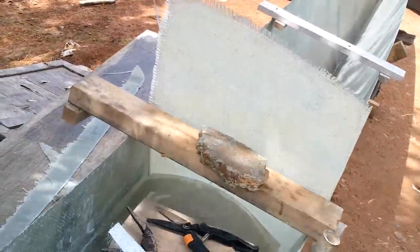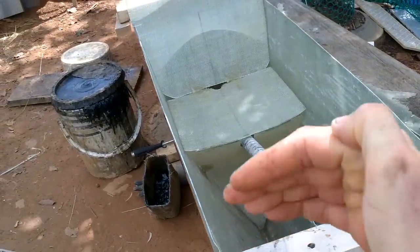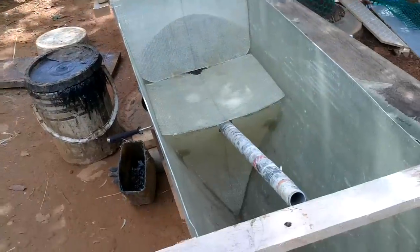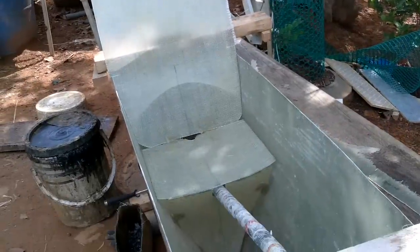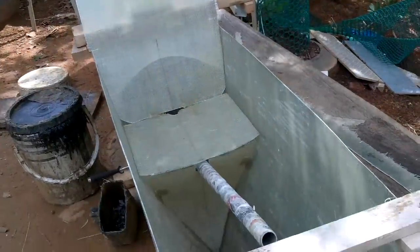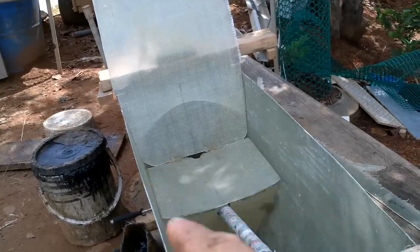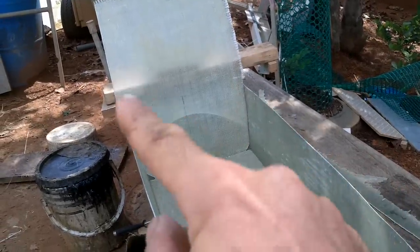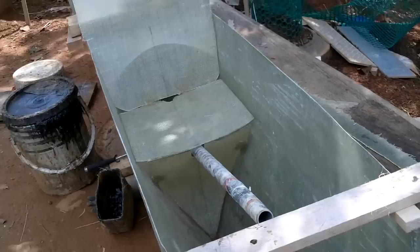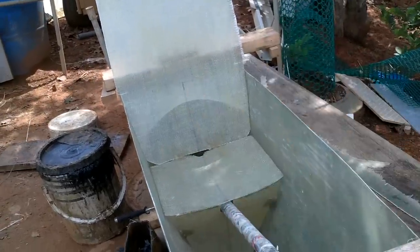So I started working on the chair today. After like an hour of trying to get one sheet to come in and make the whole thing curvy, I just cut it up into three pieces so I could actually get it lined up exactly where I want it. So first I put this piece in and put a tiny bit of resin along the seam, then that piece with resin on the seam, then that piece with a bit of resin. And a couple little tiny strips of fiberglass just to keep it all in position.